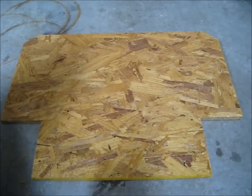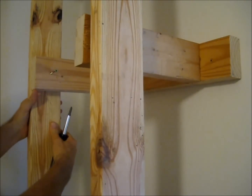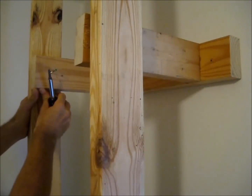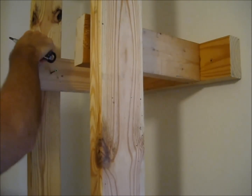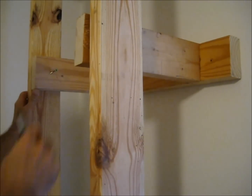If you don't have a tall ladder, it may be easier to skip ahead to make and install the top shelf while the ladder is laying on the ground. Hold the ladder in place and screw the ladder to the standoffs. If you're installing the ladder over carpet, be sure to press down on the ladder to compress the carpet while you attach the standoffs.